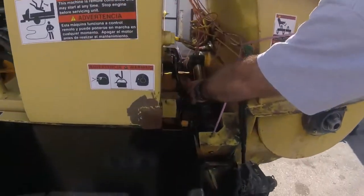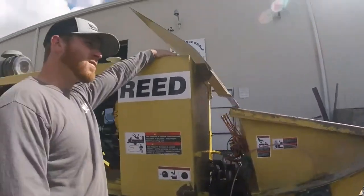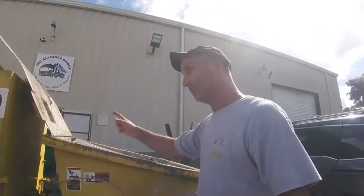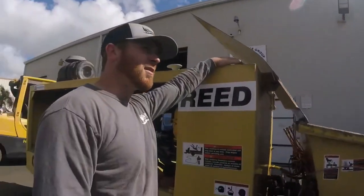Okay, so you got your switchover levers. These are the cylinders, and then when you get the signal switch, boom, boom. So if one goes bad, you'll see it every other stroke, because you get pressure on this side, and this one returns back to tank, boom, it's off over. When it's pressure on that side, boom. That's when you know they're going bad.